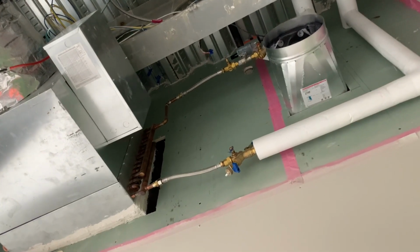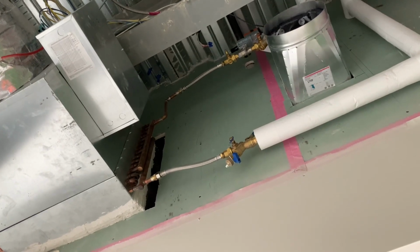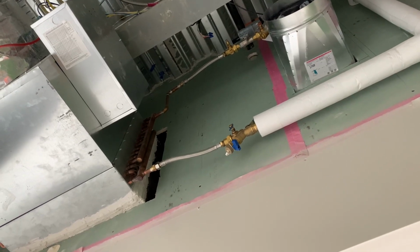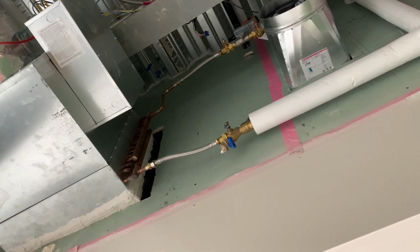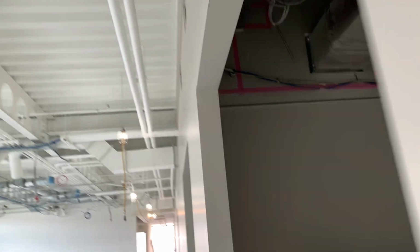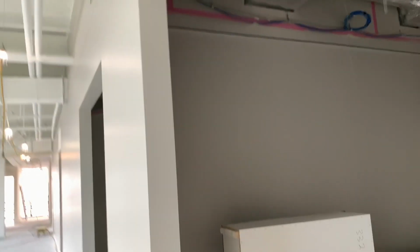and we are leaving coils, little service loops, if you want to call it, or little coils of wire above the unit for spare, in case anything has to get moved or anything like that. It's always a safe idea to leave a little bit extra wire. And then there was a little makeup outside for the low voltage, and I'm not sure what that controller does or what that exactly does. I think it has something to do with water possibly. And there's a 3-foot whip, and that's way too short to reach pretty much any of these, so I have to extend that and add a wire and then wire nut that in the air.